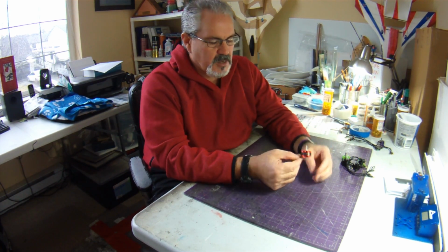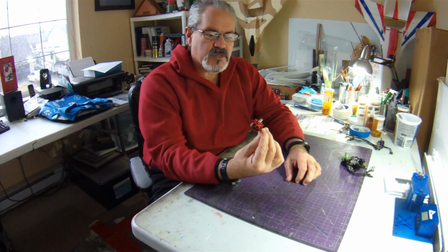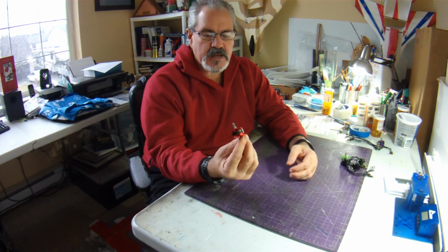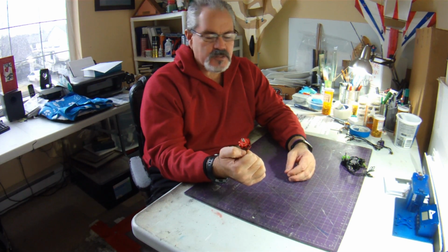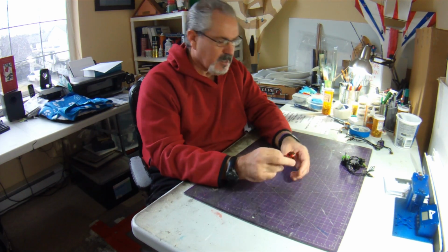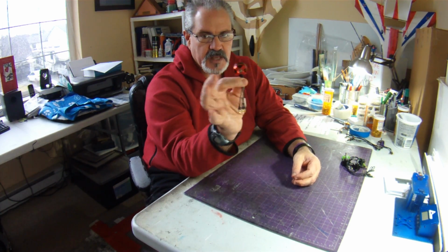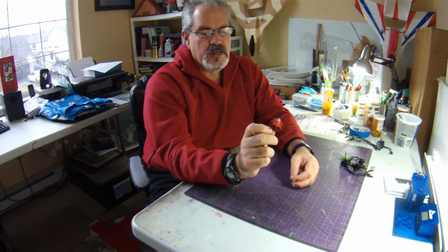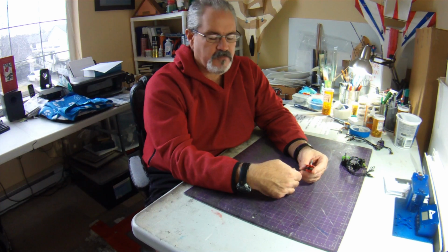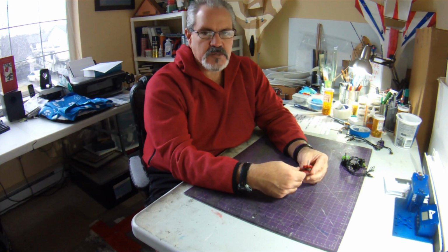This one was actually one of the really pleasant surprises. This is the Racer Star BR2306S 2700 kV. It's very inexpensive, only $8.99 at Banggood, regular price. Quite light actually, 44 grams, 1.6 ounces, and pretty efficient, 29 amps even on 3 cells. So you might even get away with running this on a good quality 30 amp speed controller, like a Turnigy Plush 30 amp, which has a 40 amp burst rating. I think you might be okay. You just might have to be careful with throttle management and check it regularly for heat.